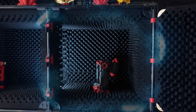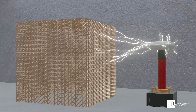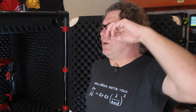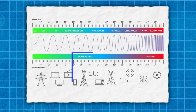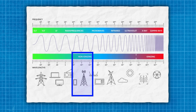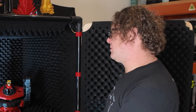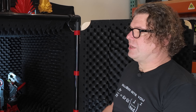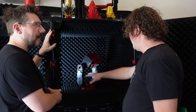Because of the motion of the gimbal, you get a 360-degree reference of the pattern it's creating. You want to be in an anechoic chamber so you don't have stray reflections. This material is highly carbon loaded — it absorbs waves, radiation, and any energy, like a sound booth that eliminates echoes. A Faraday cage avoids interference from outside; here, they're not concerned about outside interference but about stray reflections inside. They're operating from 18 GHz to 330 GHz — approaching infrared light — so internal reflections are the main concern. The chamber walls are built from 3D printed parts.